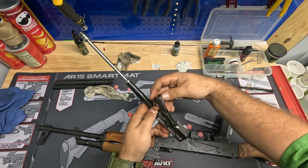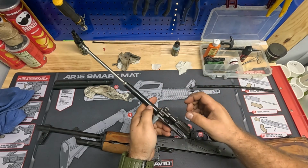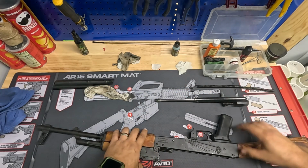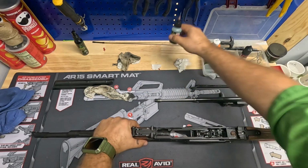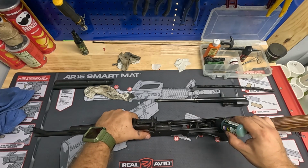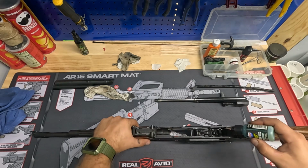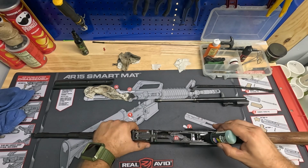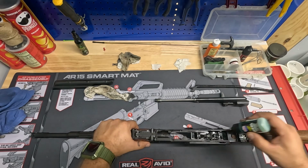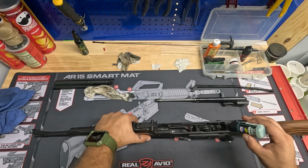So we'll take our bolt and we'll slide it back in. And it just slides just like that. Now, you need to oil on the receiver. Anything that's going to touch metal. So right across, all the rails across here need some oil. Your springs need the oil. Your hammer springs need oil. Your safety wouldn't hurt to have some oil so it functions properly.